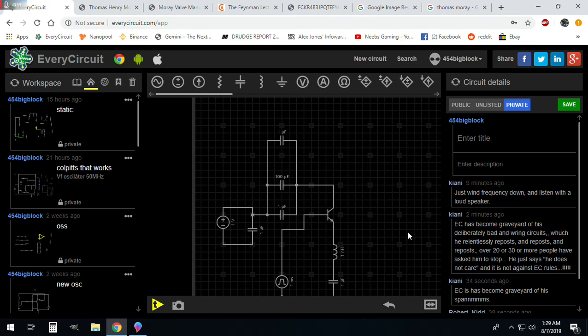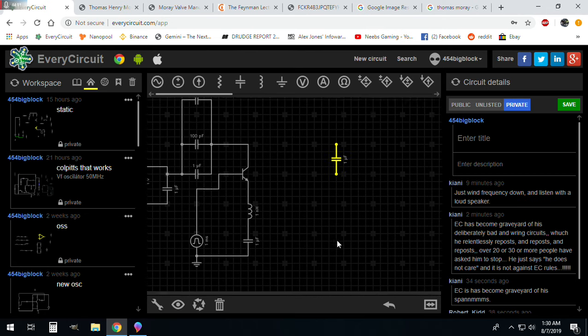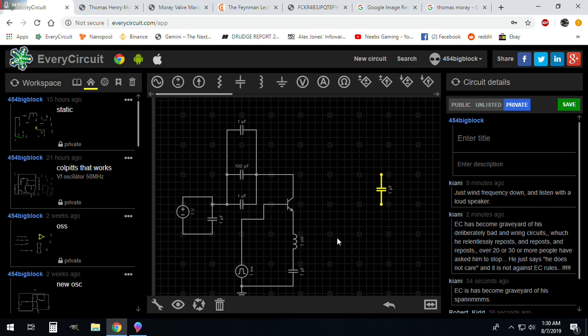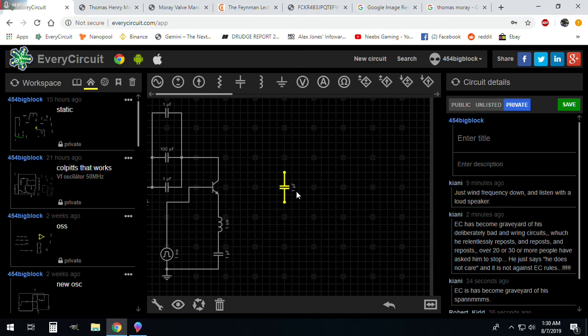And you want to just keep filling capacitors until you've got enough accumulated that you can do stuff with. So once these capacitors are full, they dump into this resonant circuit, and you've got some bigger reserve capacitors where it eventually gets dumped into. Once these reserve capacitors get to a certain point, they can be discharged through a transformer or whatever you're going to do to make them usable.